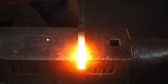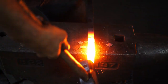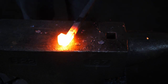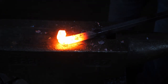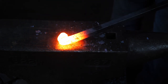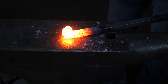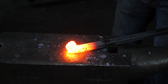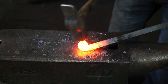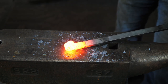First step is putting an inch over the outside edge of the anvil and I want to bring that down on a 90. Once I've got it down on a 90, I want to curl it back on itself. At the same time I'm rounding it out, trying to form the back of the skull. Now that I've got it in two dimensions, it's time to start rounding out the edges.